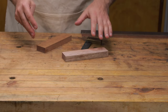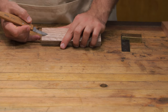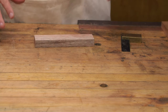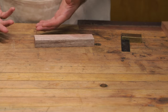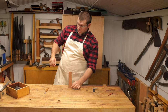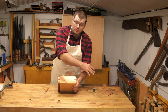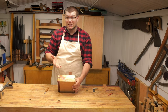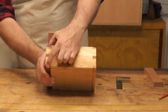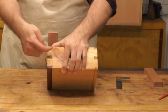We do the same on the other piece and then get into marking our dovetail. I prefer to start with the tails because the tail is easy to transfer onto the end of the next board. To cut the tail we have to decide how big our pins are going to be. The half pins on the outside are purely aesthetic — nearly all of these outside half pins are half pins because it's only half of a full pin.